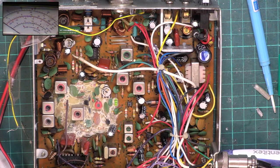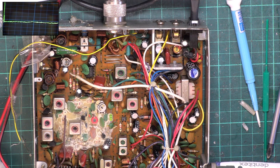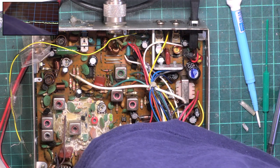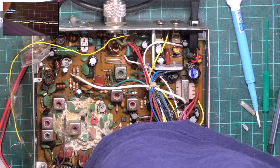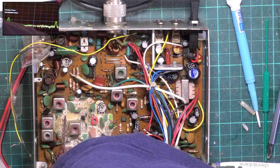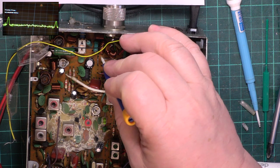All right, let's look at the spectrum analyzer. Auto, let's see what we can find. Okay, so let's look at it manually. Frequency 2779125. Enter. So as you can see, we've got a naughty peak at 54 megs. We'll just see if we can improve that.